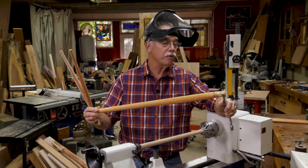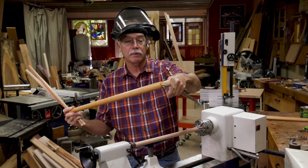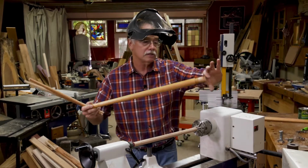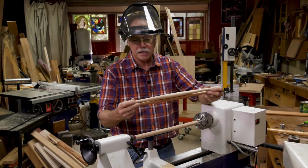And that is how the 3 legs are made for the stool. And I'll tell you, buying a wrench like this, $11 is the best caliper, because what you can do is actually compress the wood fibers of that tenon down with that wrench to get it perfectly sized so you get a super tight fit. Now, we need 3 spindles, and the spindles are all the same.